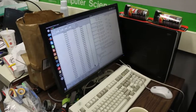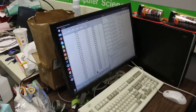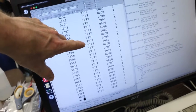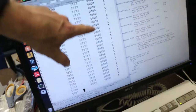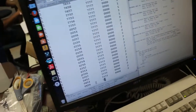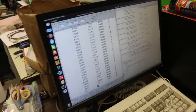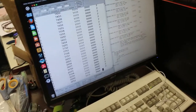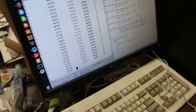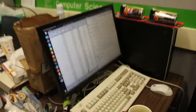We're back and we've put the other 4K core in and we're running the test. What you're seeing here is this column is what the data is supposed to be, and this is what we're getting back. We're getting lots of zeros, but we're supposed to be getting sevens. This is very different from the error we saw before, where we were adding or losing bits but getting more or less the right value. This is significantly more broken.